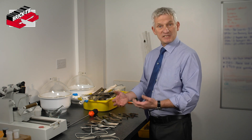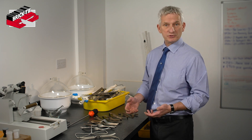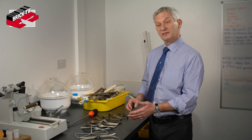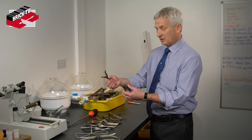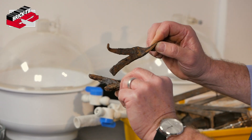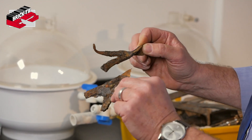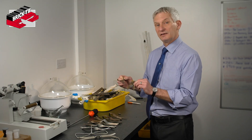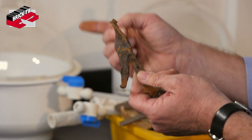This is why as surveyors we have to protect our clients against the consequences of wall-tie failure — we have a duty of care to both vendors and purchasers. We'll describe the stage of corrosion and tell you whether it can be monitored or needs dealing with now. The end result can be complete failure. This is aggravated by the presence of black ash mortar, which was commonly used with aggregates from industry containing a lot of sulphur. This makes it slightly acidic rather than alkaline, and as a result it strips off the protection very quickly, leading to complete failure.